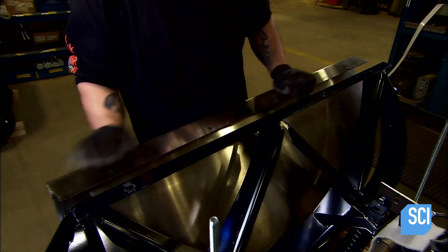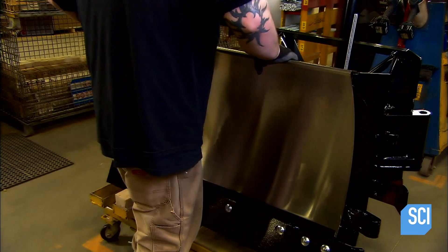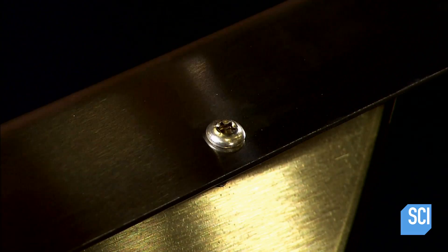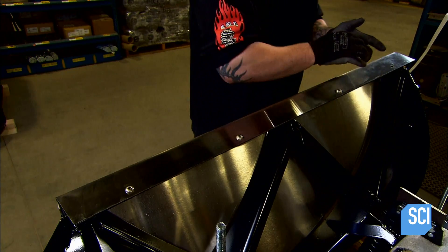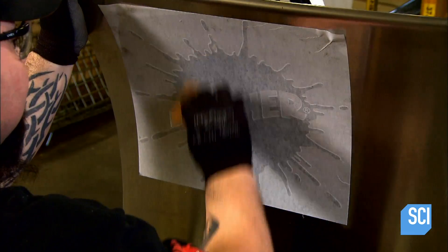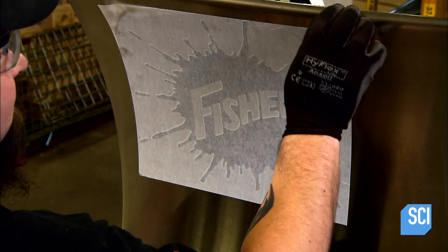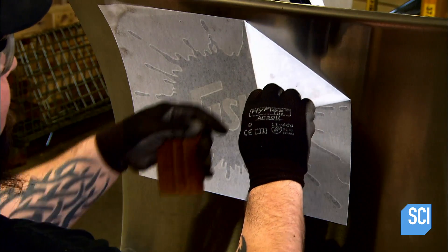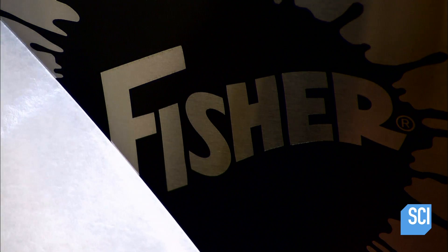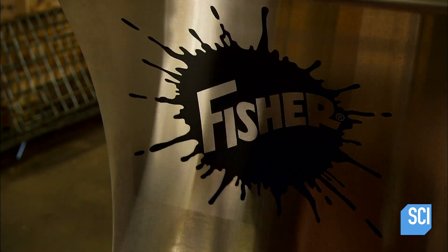This one is getting a stainless steel blade. The bent top fits over the structure's top bar, the bottom into a slot below. Workers secure the blade with bolts, then finish off the plow with the decal. For this model, they make two plows like this — mirror images of each other — which go side-by-side connected in the middle by a hinge to form a V-shaped snowplow.